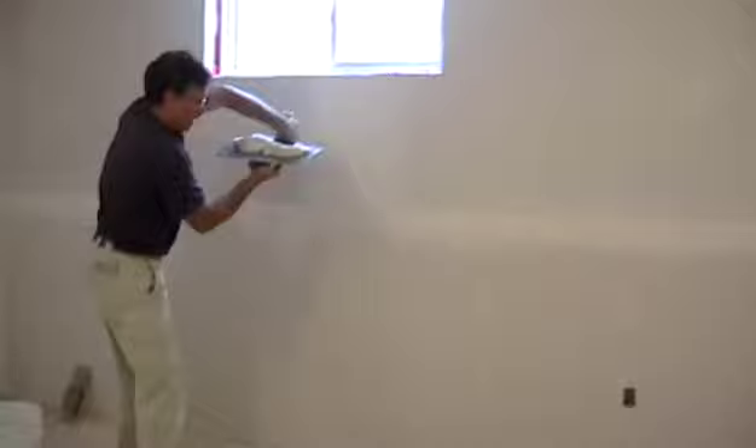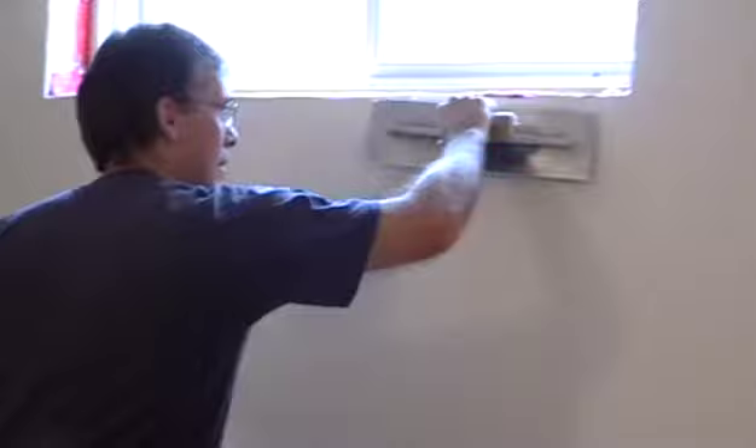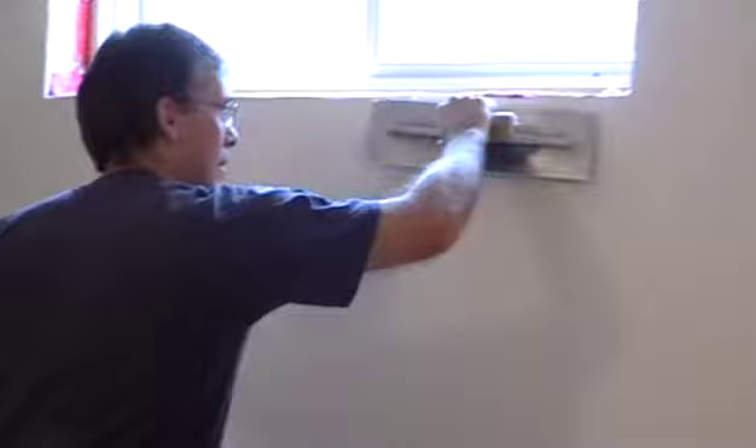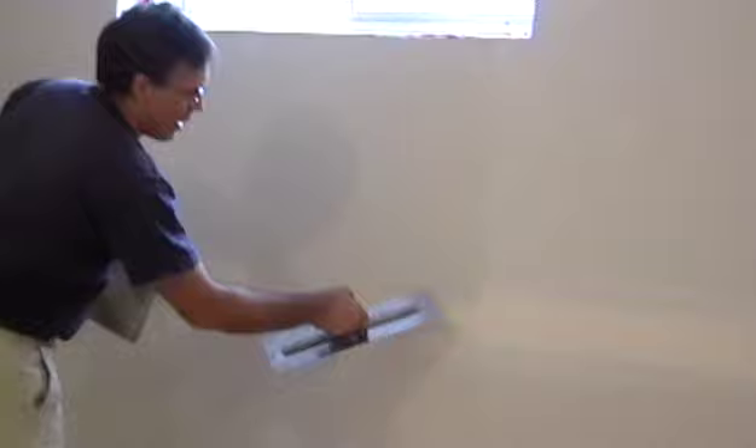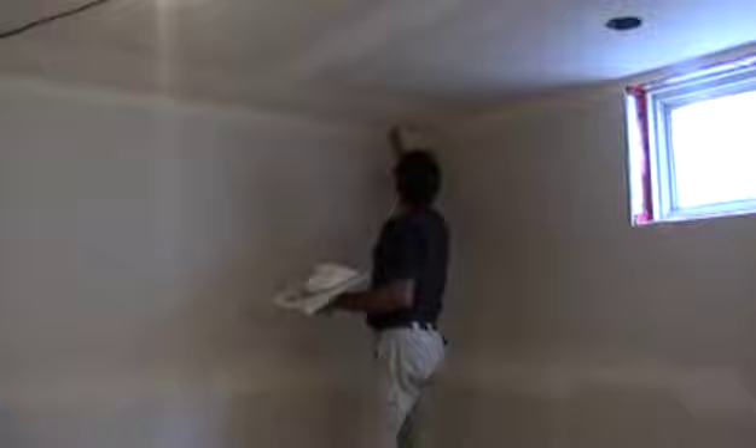Let's do this one - front end this time, upside down, load the whole thing. Come in. I'm laying this trowel down even though I'm pushing higher. I'm satisfied with the amount of mud loaded up. Now it's reduce time. I'm going to press mostly at the tip end of my trowel - feathers it off against the board. Now I'm going to press mostly at the back of my trowel - feathers it off against the board. Last swipe is the center. There is a draw line here of mud and another draw line there - no big deal. We just do a little scrape before the finished coat and continue on. I organize my mud and we'll get a bit of this ceiling mud joint.